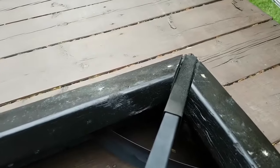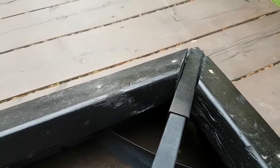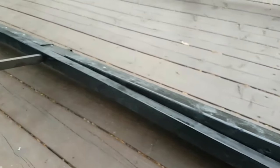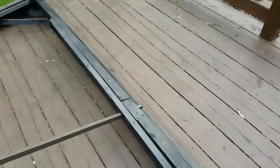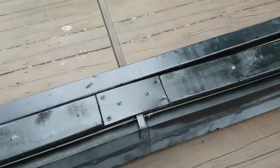Second, build the frame. You will need to screw the panels to the frame, therefore use wood. Paint the beams before installation. You have to determine how to cut the ends of the wooden beams, and believe me, you will need to extend them as much as you can to drive in the screws at the corners.